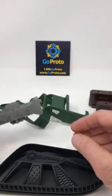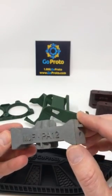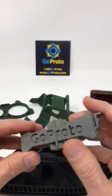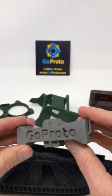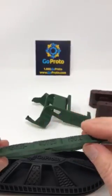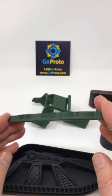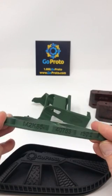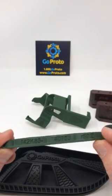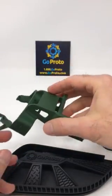What I wanted to show today was graphics and text. This part has Multi-Jet Fusion PA-12 printed in. It also has a GoProto logo printed on the back side. I wanted to show some part numbers — this again is a green dyed part. Anything in a 3D printed part that is about twenty thousandths of an inch or greater in either line weight or height or width is going to print acceptably in Multi-Jet Fusion.